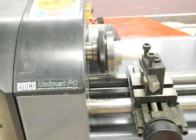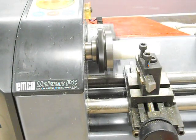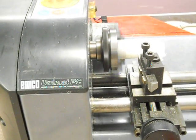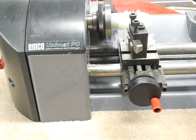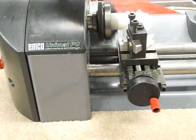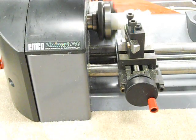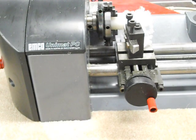I've got the carriage advance working. It's got a lead screw right in the center between the two legs of the carriage. It's actually taking quite a good cut right now in Delrin — about an eighth of an inch off. That's a pretty substantial cut it's able to do with Delrin.